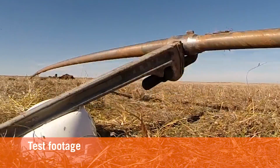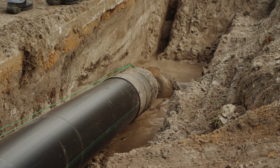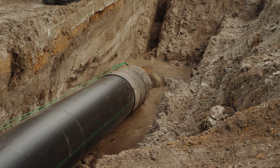Pipe wrenches can fly loose from under a backhoe bucket or fly off the drill pipe and strike personnel with enough force to kill. While pulling back product, the reamer must be pulled up to the borehole before rotating to prevent the back reamer from walking to the side.